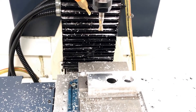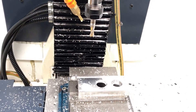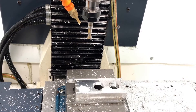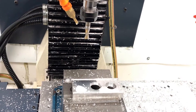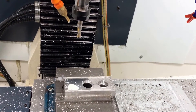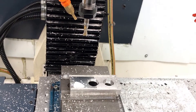What I'm going to try to do here is thread mill an ER-20 collet nut — basically an internal thread ER-20, which is an M25 by 1.5. What I want to do is make an adapter for a Renishaw probe that just threads into an ER collet chuck.